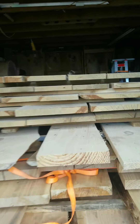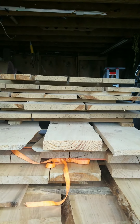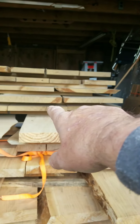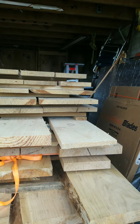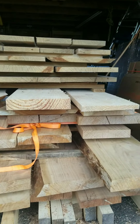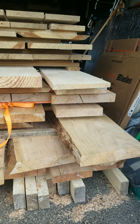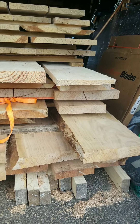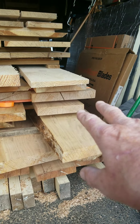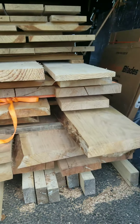From this layer here — that's the white oak I got out of it today. It's got some nice boards. On the end, the bottom one and this one here look like the pith's still in there — there'll probably be a little crack — but I'll be able to get something out of them. I try not to waste it. Like the cherry down here that's cracked — I put a band on it to try to stop it. You can always put a bow tie inlay in there — I forget what they call them. And somehow one of these days they're going to make me some pinch dogs, and you spike them into the end to keep it closed — gives it a fighting chance at least.